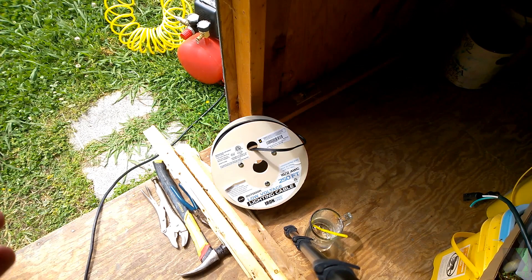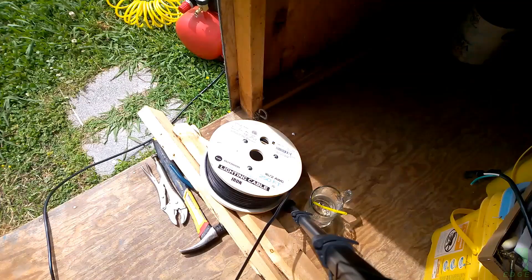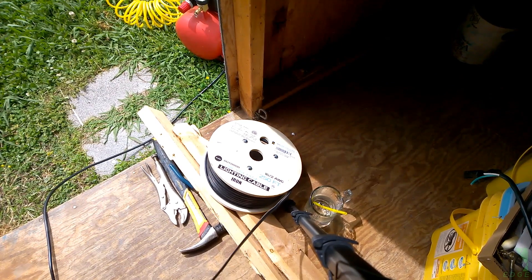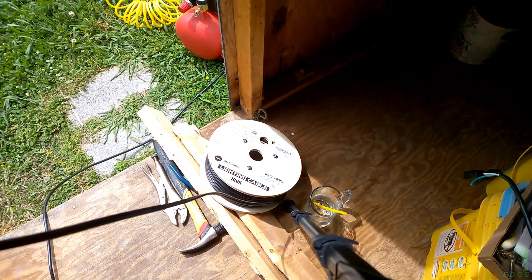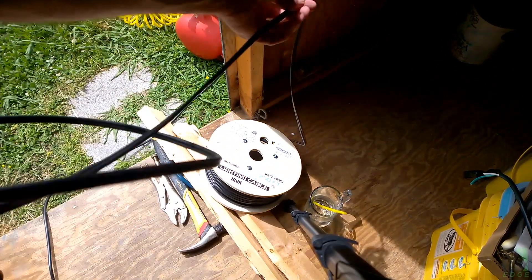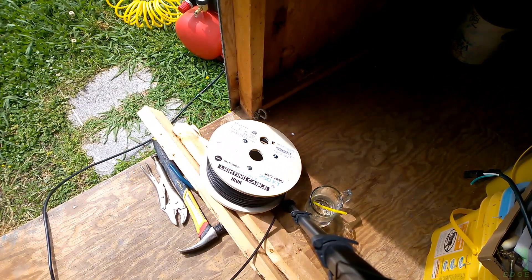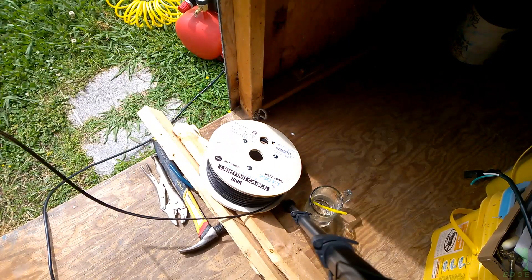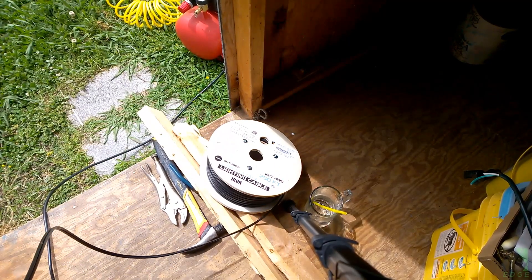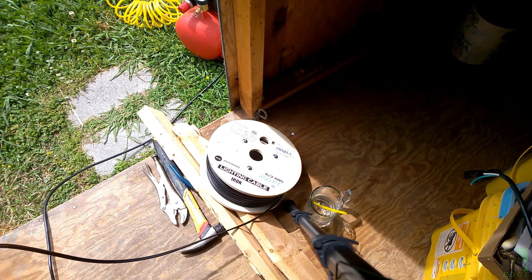This wire is not suitable for high-end solar stuff, but for fooling around in the shed it should be just fine. The wire is only 16 gauge, but all I'm doing is running a fan — I think it'll be more than enough. I have this strange hang-up with wire: if I don't have a lot of it I don't want to use it. So I got myself 250 feet. I'm going to run this wire across the shed from the original connections and use it to make the connections — if I change my mind later I may rewire it all.